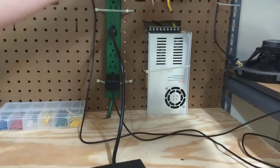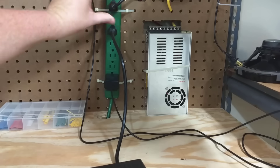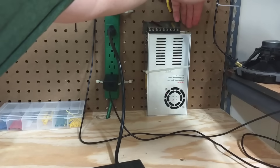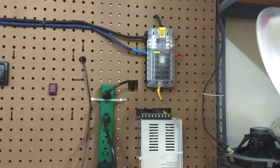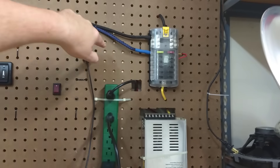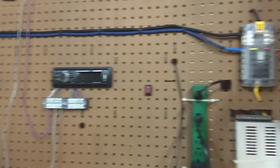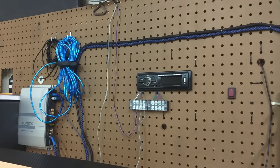You can find YouTube videos explaining how to use a computer's power supply to run 12 volts at home, but I don't recommend that. I'd much rather buy a power supply intended for this purpose. One key thing to remember: yes, this is a 348 watt power supply, but it will not provide enough juice to run a 348 watt amplifier. Don't push these things to their extreme limit because they burn off a lot of power as heat, so keep that in mind whenever you want to hook up a car stereo in the home.